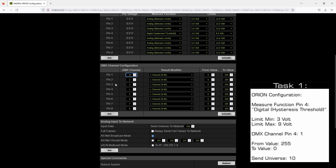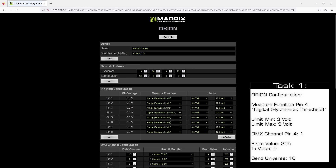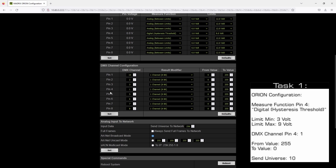There are different possibilities if you want to trigger the DMX fader for the master to zero when the button is pushed. In our example we will send the value 255 when the button isn't pushed, meaning the contact is open, so the minimum value is 255. The maximum value — when the button is pushed — we set to zero. It's like an inverted channel configuration. Now we click Set to accept this option.